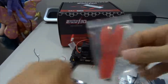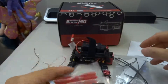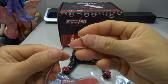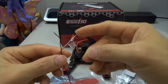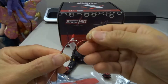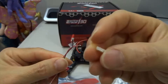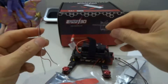This comes with two different sets of wires. With one of them you can connect to your flight control board so that you can control the on/off switch of the camera with your remote control. It came with eight props, which means two sets of props. It also came with this wire connector for the receiver, because the wiring is different from the receiver I bought, so I have to use the original. This is a micro JST plug, four pins. I used the three-pin one and connected it to my D8 receiver.